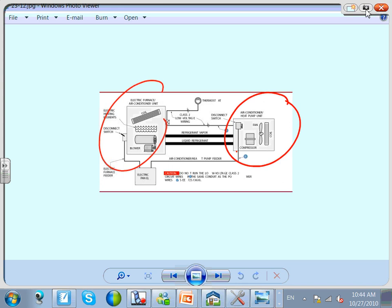Is it smart to put it on a separate circuit? Yes. They're big loads. Why would you share it with a receptacle circuit? Because you don't have room. Well, I just did that cabin and I ended up having to put the outlets in there because I didn't want to cut them into the floor. I pulled individual circuits, hoping to go to one on each side, but they wouldn't even let me pull the wire through it. By the manufacturer, you have to pull one to each side. And I also had 240 running the baseboard heaters, so I would have to have four circuits if I wanted two receptacles on the 240.